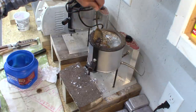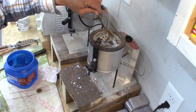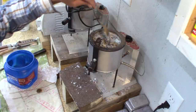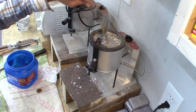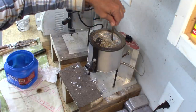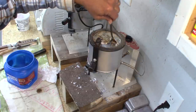I measured the temperature in this pot right now, because I typically like to run the pot hotter when I'm fluxing than when I'm casting bullets from the lead. Right now I measured the temperature and it's at 860 degrees.